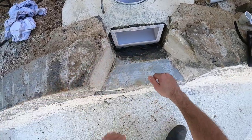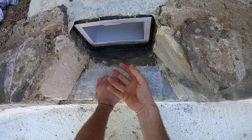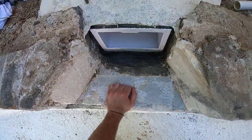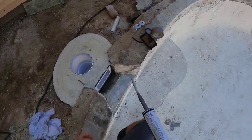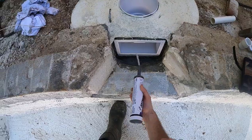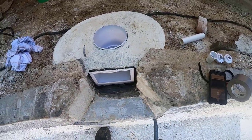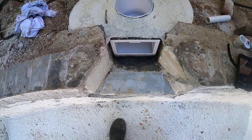The point in doing that was really to allow us to put a bead of urethane around the skimmer, almost creating a gasket. Another thing: if you're pouring a skimmer, it's highly likely you could end up with a void underneath the center part of the throat here — it's pretty difficult to get the concrete agitated enough to really flow and fill in that void. On this skimmer, if you tap on it you can hear the sides are very solid, but out towards the center there is a bit of a void where the concrete didn't fully flow. I was able to take my urethane with a little piece of quarter-inch tubing on the tip and actually wiggle and wedge that tube in under the skimmer and pump a ton of urethane sealant into that void. Now as I tap on it, it's very solid all across the front face.